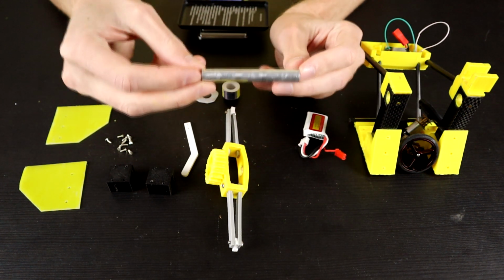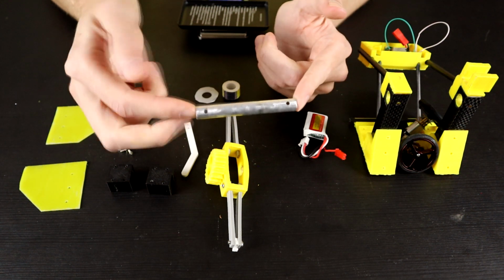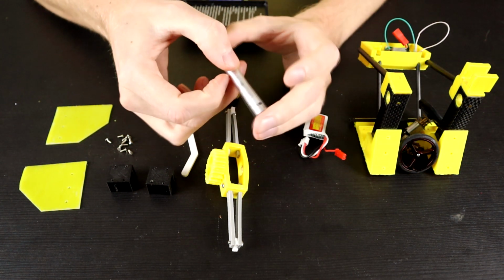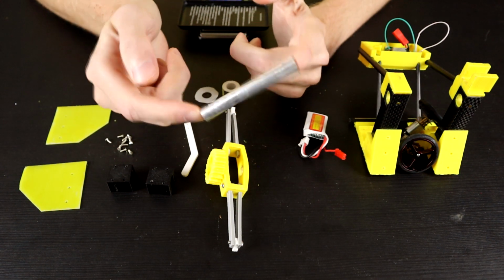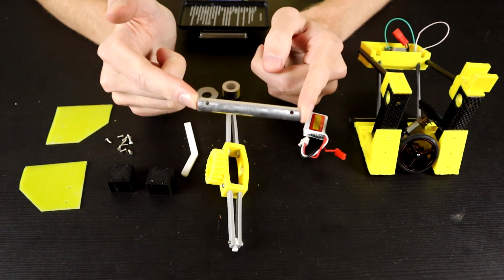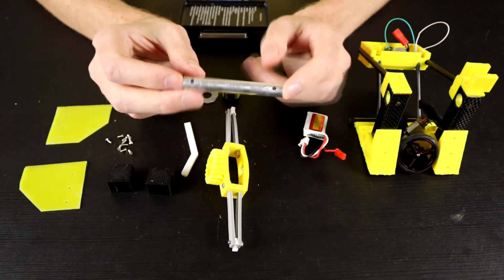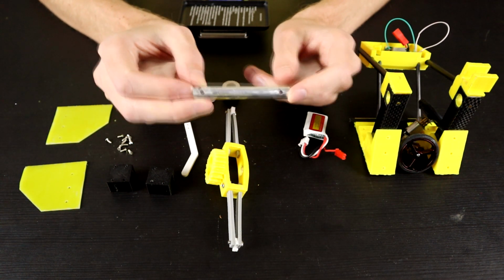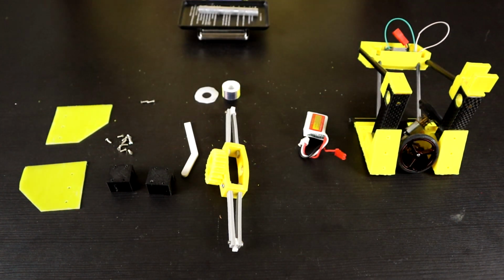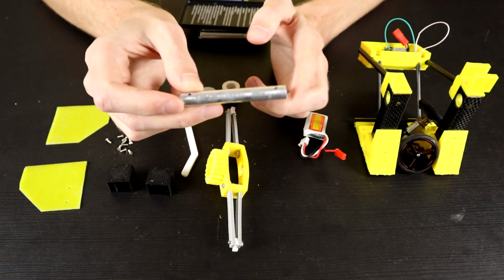Next is the thing that I think I'm probably going to have a large saving on. This is the aluminium tube that I run the weapon on. It is quite long. Oh, but it is only 6 grams. This is why I am advocating for finding where your weight is, because I assumed that this one piece was going to be the thing that was tipping me over the edge. I thought this was going to be in the order of like 15 or so grams, and by swapping it out or shortening it and adding plastic extensions, I would maybe be able to make up all the weight that I wanted to in this one piece. But that's why we test all of the different bits and pieces and see how much weight there is in there. So like I said, this is 6 grams and I'm looking to save 4.